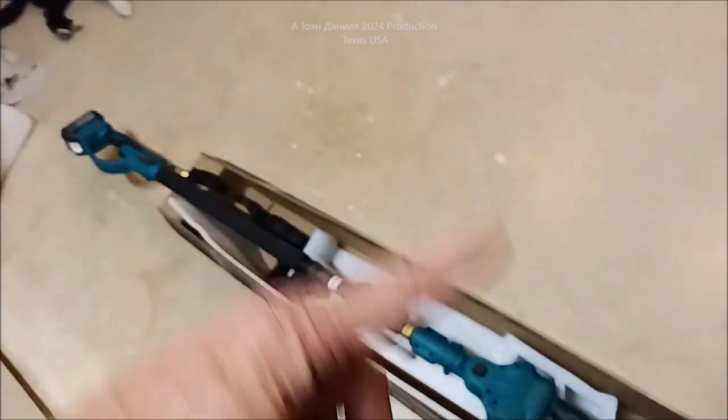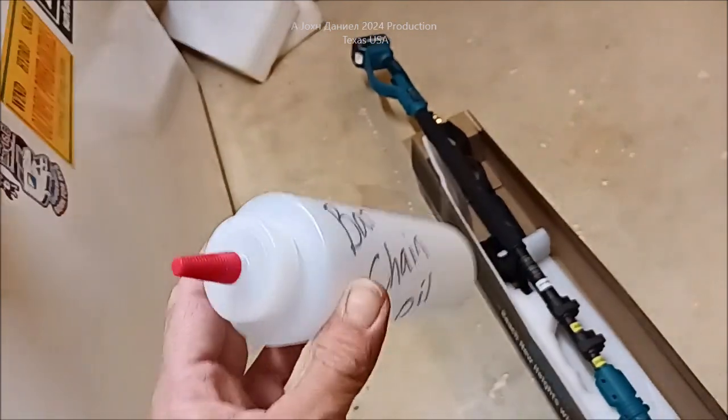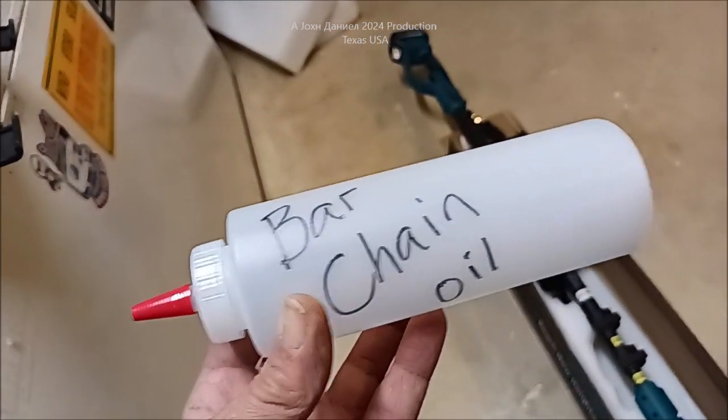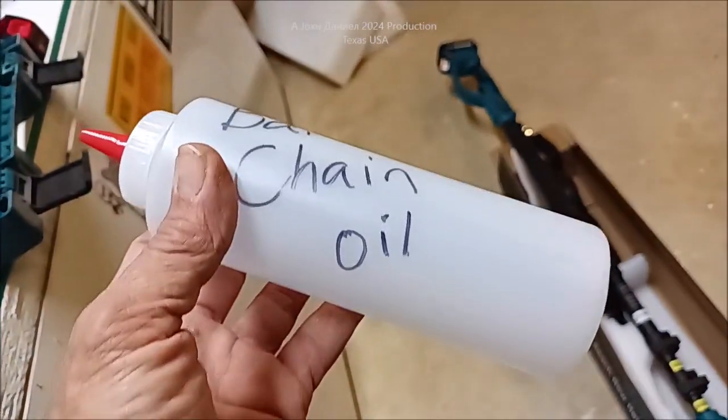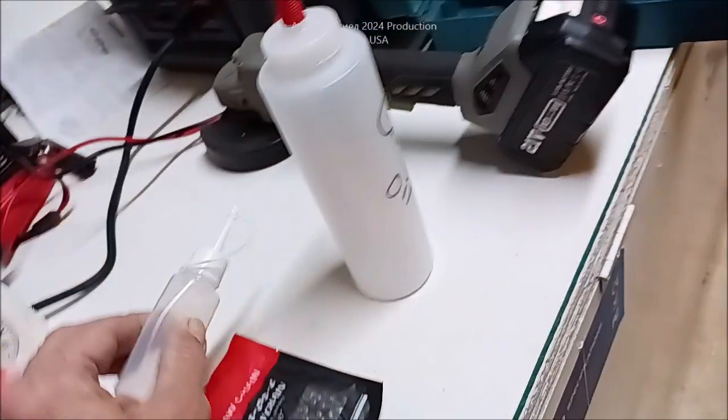And if they do, you've got to lower it to the ground, rev the motor, and then bring it back up. So you're only going to cut four or five limbs, clear the area, put a few drops of oil. I just got me one of these - it's about a buck at the dollar store and it'll hold a pint. Okay, that little included bottle holds about 40 milliliters. And it's kind of squishy, so no thank you.